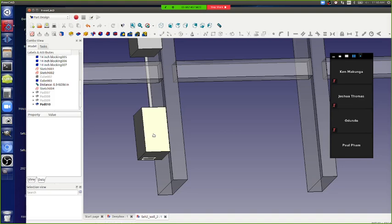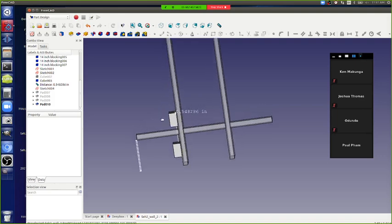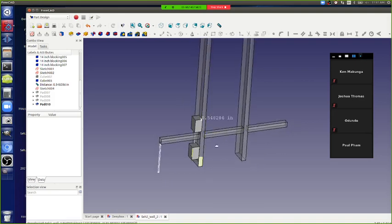So when we run the wires at the end, whatever wire goes into here, we'd either break into that wire and continue into the box, or terminate at the box. If you terminate at the box, then you're still connecting to the junction box. And this way, this already has the electrical pre-wired, so you don't have to mess around with putting in all the wiring. This is pretty simple, so it's not too bad, but it saves you the work of running the wires at the end.